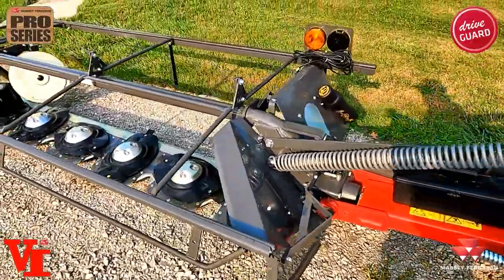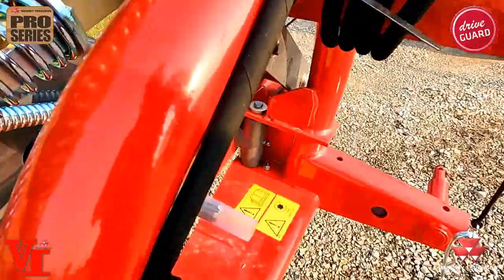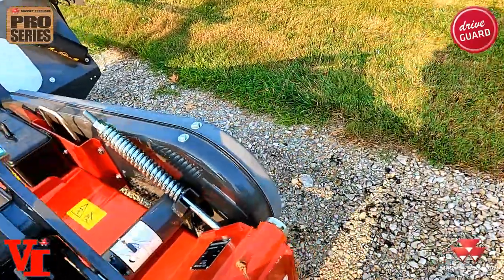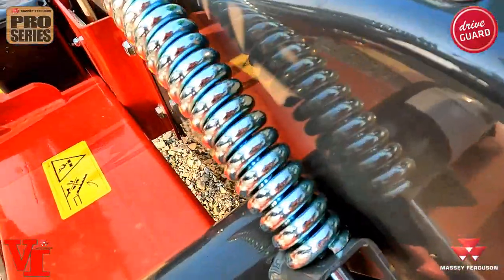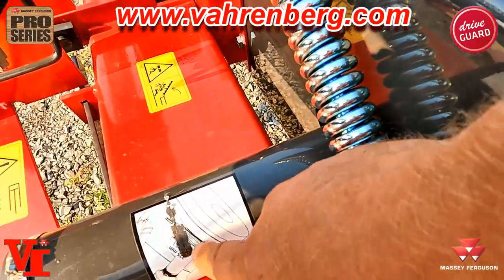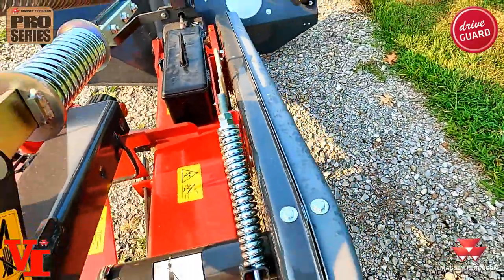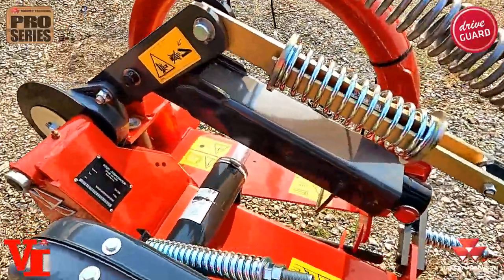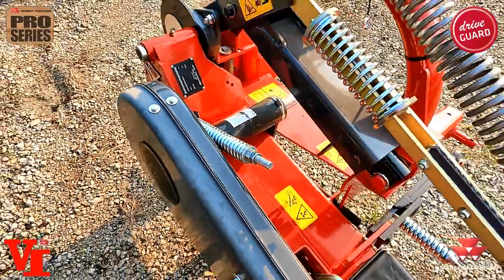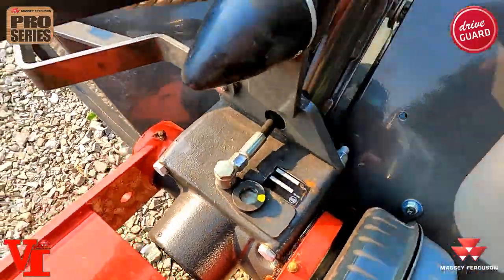One of the biggest things is that this bar is belt driven. You've got a belt that drives from your PTO shaft, connecting right in here, featuring a belt drive. One of the improvements I think is the biggest is the automatic adjustment. There's a label right here that tells you the dimensions — 8.9-inch length from this washer to this surface — for that spring constant belt tensioning. New Idea owners will appreciate this because you're constantly adjusting that bolt, and now we have automatic adjustment.